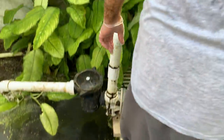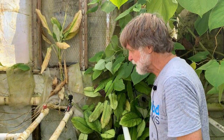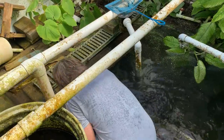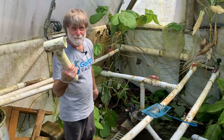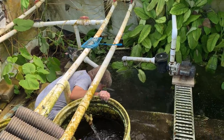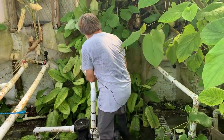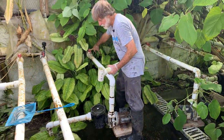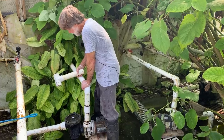I wonder what happened to my brick that I used to open this. It probably got kicked off into the sump - I'm not going to go sump diving. This is a specially designed hammer to open up these filter cases. The first thing I'm going to do is reach up here and unplug this pump and turn the power off. This valve controls water from the pump into the four-inch manifold there and then out each of the lines, but I'm just going to let water run through.